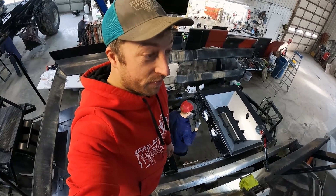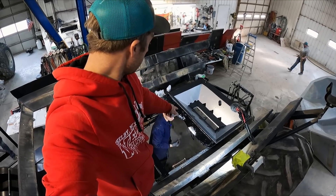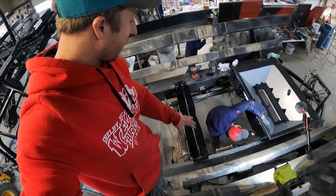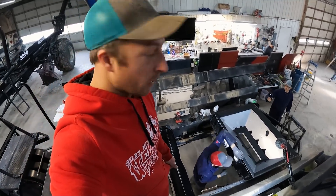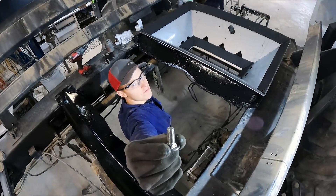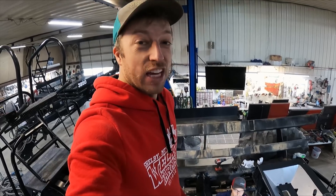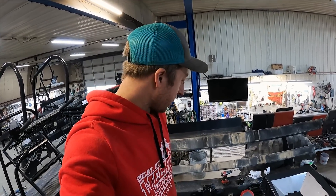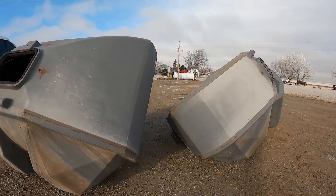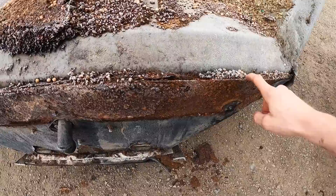The 4350 cart has its first cradle in. I put some direct-metal Rust-Oleum paint across these things — hopefully it'll prolong the life and surface rust won't happen for a while. They just put the new stainless steel cradle in with seals all around. On that one, tanks are off, same thing — painted. They do stainless steel at the factory, but then it would cost another fifteen thousand dollars. Out here we have the poly tanks pulled out of cart number two — the smaller cart — and you can see the corrosion: entire pieces are coming off, the metal's a lot thinner than it was.